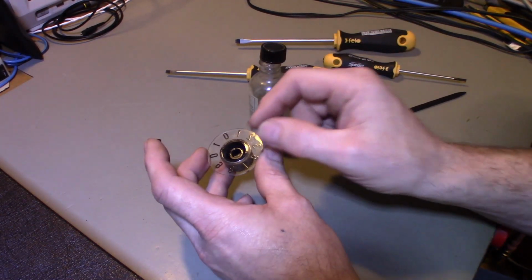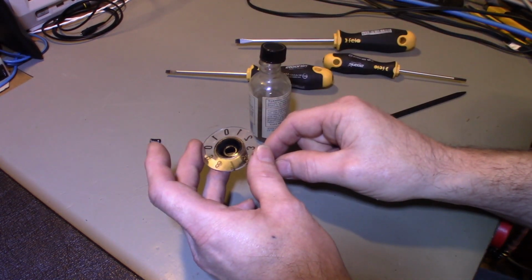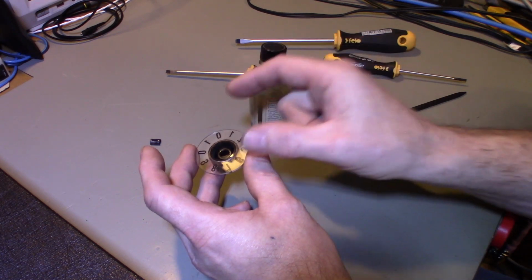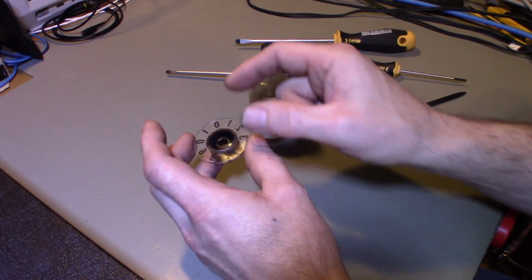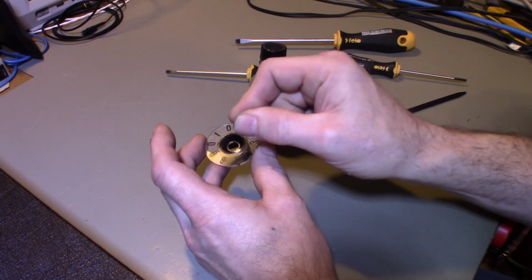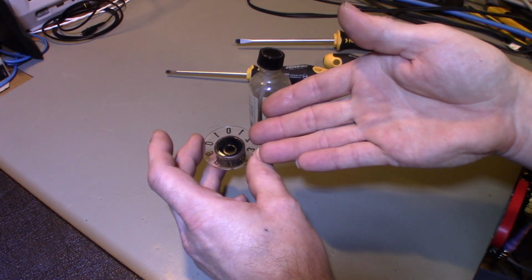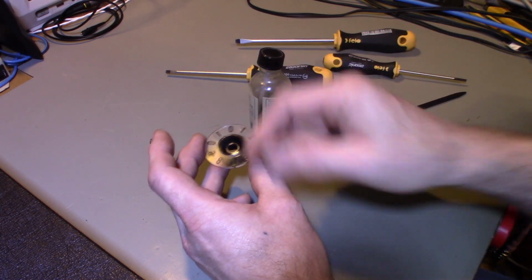No, no. You just need to melt basically a microscopic layer of the crack, get it to a solvent melted state, push those two parts together, and then the solvent itself will dry away, and then you're left with nothing but the plastic again, but it's fused itself back together.